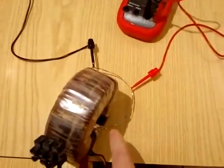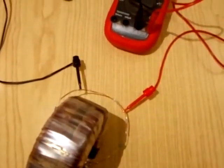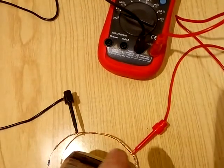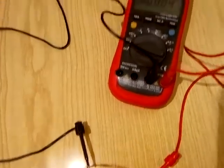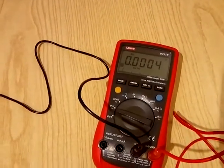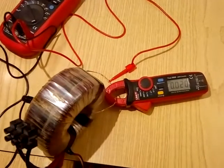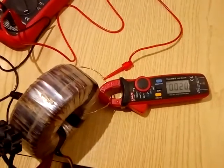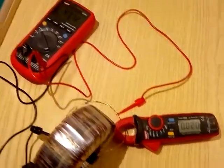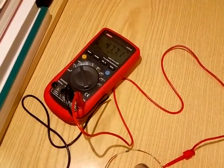Now I have placed the ring with two resistors around the transformer core. The ring is linking the EMF, a current is flowing, but the resistance of the copper between the probes is negligible, so I won't be able to see any voltage here. Just to be sure, here is the current measured in the ring — it's about 20 milliamps. I'm measuring the voltage across the smallest resistor: 48 millivolts.